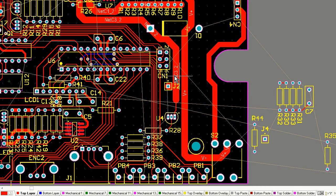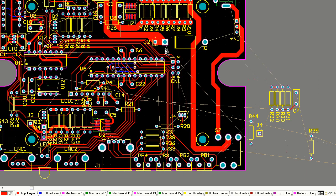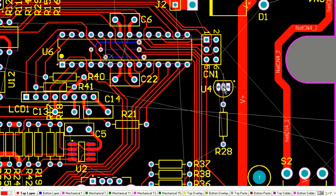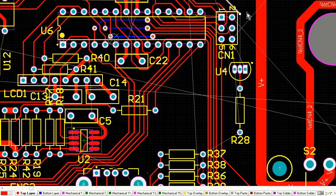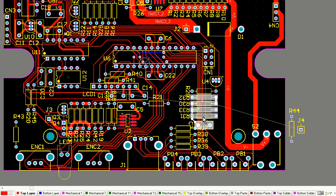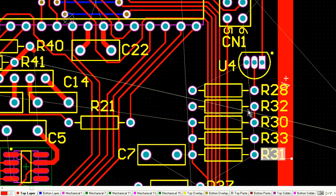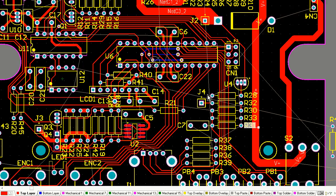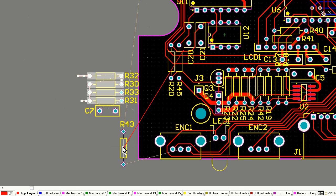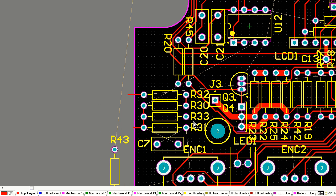So there you go. I'm laying out the output track there. J2 is my output connector there. That's my output mounting point, and that looks like the constant current source, U4 there. I've sort of tacked it around. It's a low current, so it has a 10 thou trace going to it. And I'm placing a few resistors associated with my output current sense. They're my output current sense resistors, and J4 I believe is the current sense input connector.